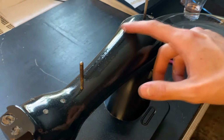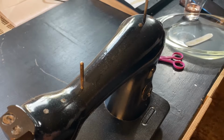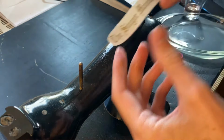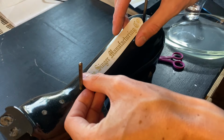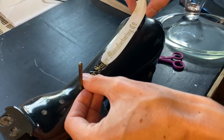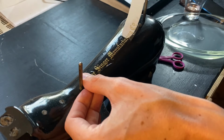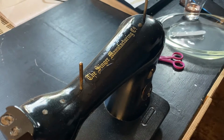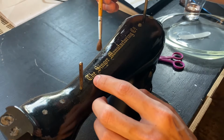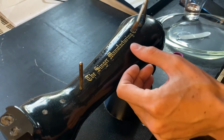So first step is to apply some water to the part where you want to apply the decal. And then you can kind of slide it off the paper. And it is covered by a thin film of adhesive on the bottom. And it's quite important to make sure not to squeeze out this adhesive from under the decal. Now I'm pretty happy with the positioning, but it needs some fine-tuning, and that's why you need to apply water to the bottom surface first, because you can slide these decals around when there's a thin film of water underneath the decal.